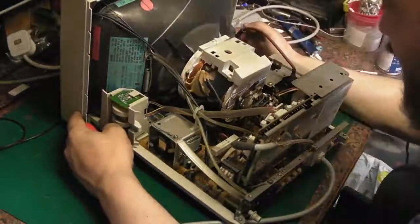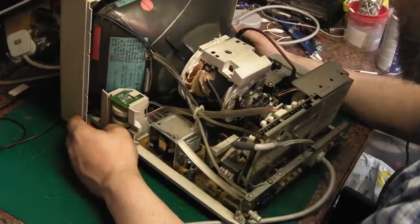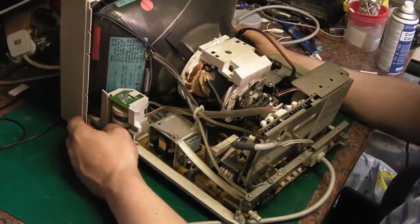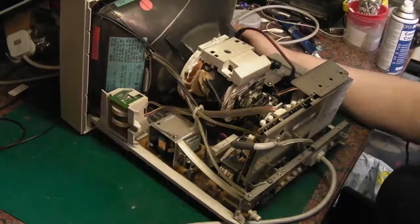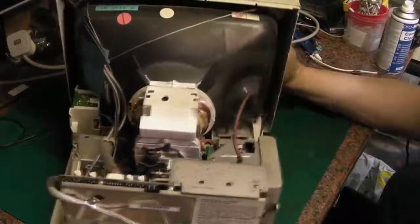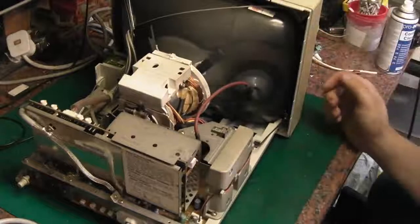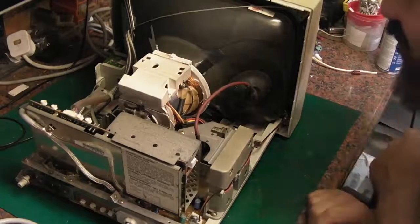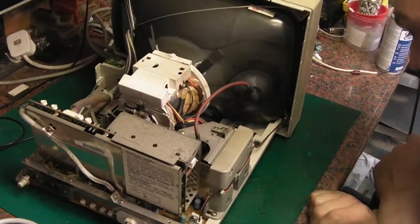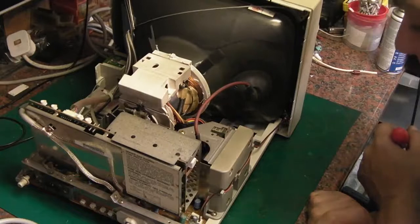And then it's going to be a case of seeing if we can find out where the fault is with it. So I've got a feeling it may have bad capacitor disease, because the power supply in the Mac certainly did have. And these don't go physically bulgy or anything, they just seem to leak electrolyte. You can tell fairly soon anyway when you start desoldering, because you get that horrible bad fishy smell that we all know and love.